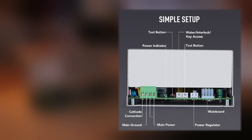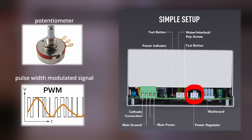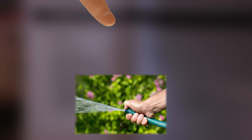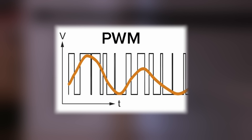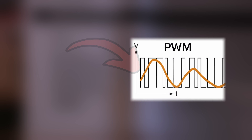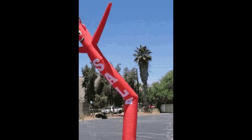Who says we can't use this function to dim our lamp like how they dim their laser? The instructions say we can modulate the output power by connecting a potentiometer or a 5-volt pulse width modulated — also known as PWM — signal to these pins on the power supply. Both methods supply a voltage to control how much power comes out, like how you change the position of your thumb over a hose to change how fast water comes out. With a potentiometer I could dim the lamp with the turn of a knob, and with a PWM signal I could do something more interesting. A PWM signal will act like a digital potentiometer, generating an average voltage that depends on the duty cycle — the percentage of time the signal is in the on state. As the duty cycle increases, the average voltage increases. Since PWM can be created by code, we can program a custom brightness for our lamp.